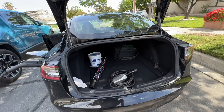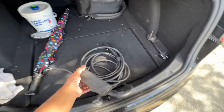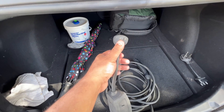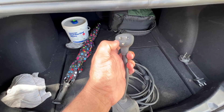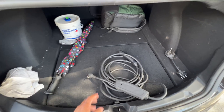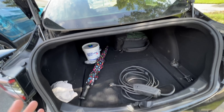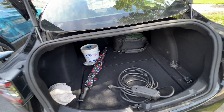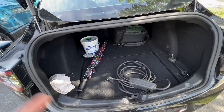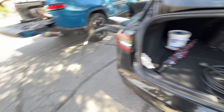The question is: why does the Tesla EVSE — or portable charging unit — not work on this setup? I think the reason is they have a bunch of safeties. One of the safeties it requires is that the ground must be bonded to the neutral, because that is a safety feature that every residential building in the United States should have. In the electrical panel, the ground bus bar is connected and bonded to the neutral. So if that doesn't exist, this will throw a fault and will not let you charge, because that means your building is not correctly connected up to code.